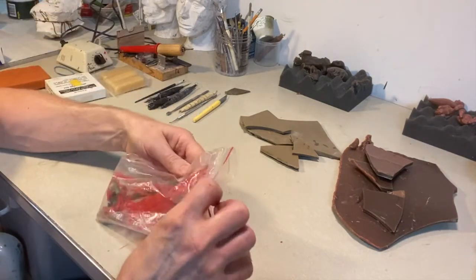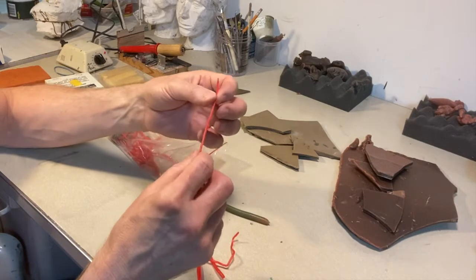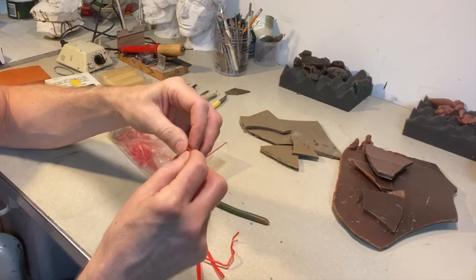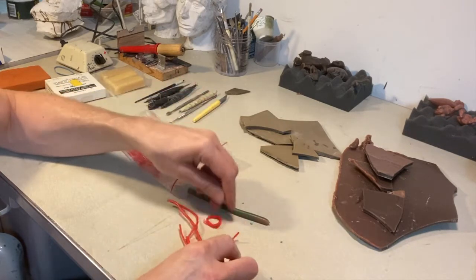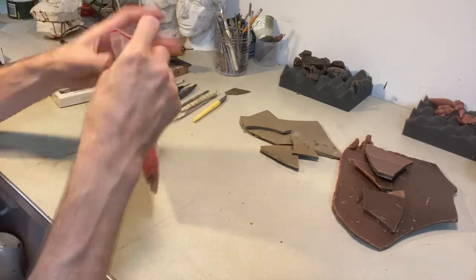And then venting and gating wax comes in these extruded rod-type forms. You could wrap and work with them. They're soft enough that you can get them to bond together and build things with. So that covers some of the types of wax you might come across.